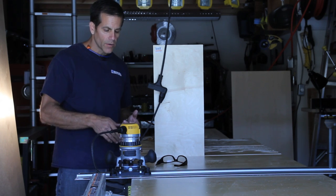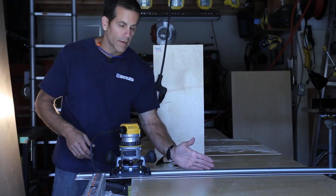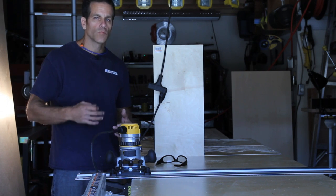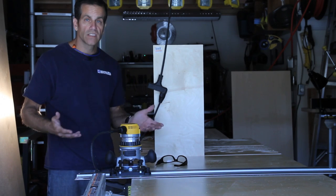What I'm doing is using my half inch straight cutting bit, making one pass and then moving my fence over 3 sixteenths of an inch — that'll give me the exact dimension I'm looking for. They do sell undersized router bits specifically for plywood; I just don't have one for this job, and this is an easy fix.